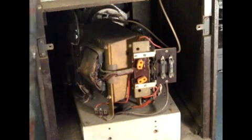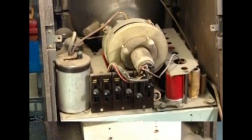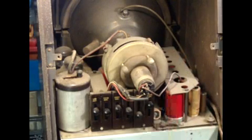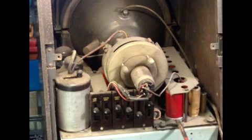Now I'll show you the main function receiver on the top chassis, which sits just above the power supply. The aerial lead comes in here. It's a TRF — tuned radio frequency — receiver, fixed-tuned to Alexandra Palace, which was the only television station in England. The vision frequency was 45 megacycles and the sound frequency was 41.5. The sound and vision channels are amplified with these red EF50 valves, a wartime development used extensively in radar and other high-frequency applications — very, very well-made. This was actually virtually an unmodified radar receiver.